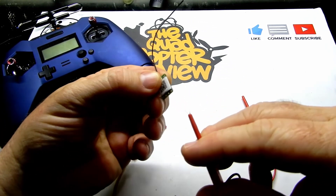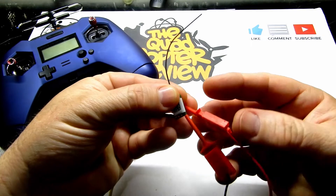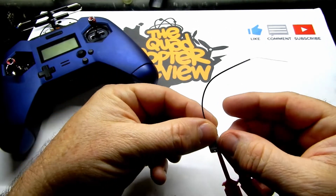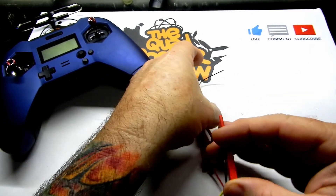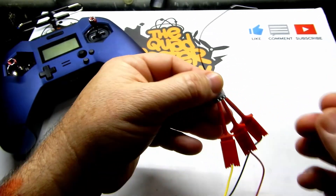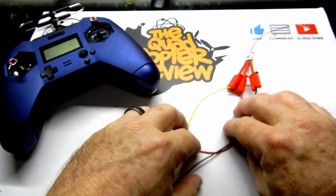What we do is take these little clips and open up the pins on this XM. We've got ground on the far right, five-volt in the middle, and on the outside we have our S-port. We go ahead and plug these guys in with the little clips. The way these clips are made prevents you from crossing your pads — the little plastic pulls itself all the way in and keeps you from crossing pads. As you can see, we're all hooked up.